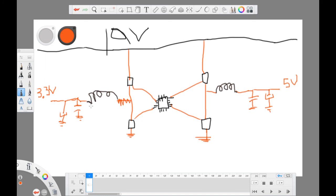Let's say you have a laptop and you are missing these volts. Maybe I'm missing the 5 volts. Now you know that you need to diagnose this whole thing. Maybe the chip itself is not generating 5 volts. Maybe there's a fault with this chip. Or maybe there's a short, one of the capacitors here is shorting everything to ground. And again, you will have the ceramic capacitors all over. If one of them is shorted, the whole thing will be shorted to ground.